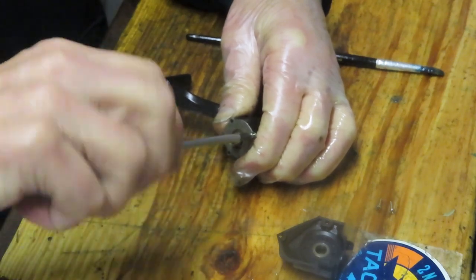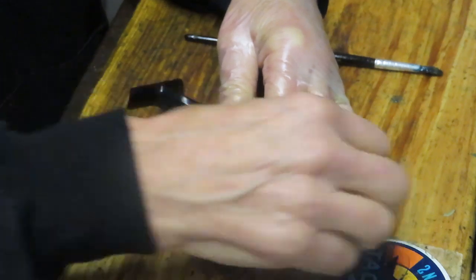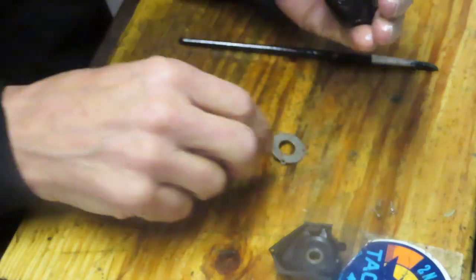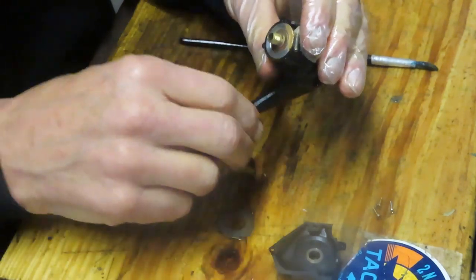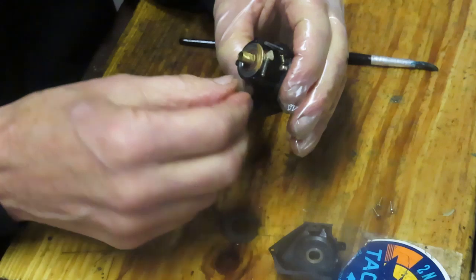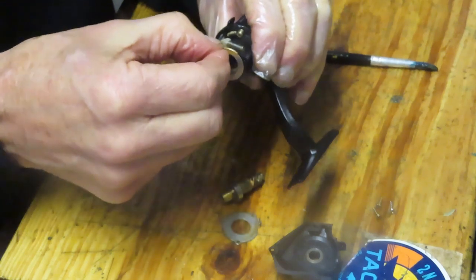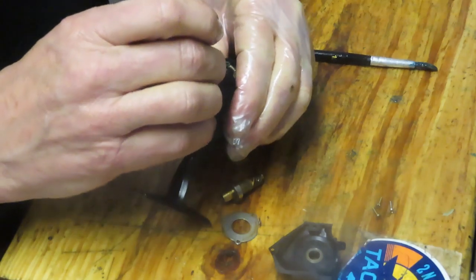We're taking a guess that I'll be able to clear the pinion gear without disturbing the spring. If I disturb it, I've got the pictures. I'll just lift it off and roll over — as it turns out, when you take that off you've got the hook for the spring. That's a good place to take your picture. We're going to pull this whole assembly up.